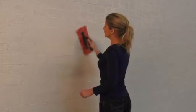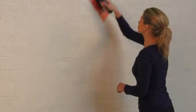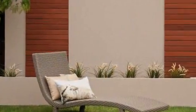We recommend a minimum of 2 coats using this technique with the possibility of further coats for deeper joints or rougher surfaces. As you can see, Dulux Texture Full Cover Roll-On provides seamless cover, an even texture and a classic, attractive render finish.